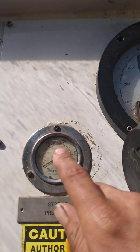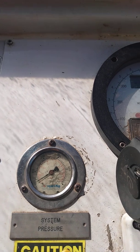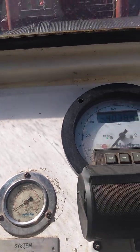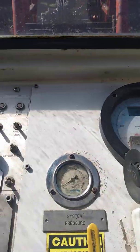But this right here — your hydraulic system pressure — that's where it's all at. That's how I know when I tag fluid, and that's how I know how much I can pull. I'm going in at 690, 700 RPM.